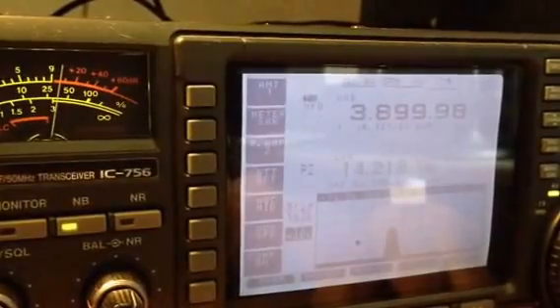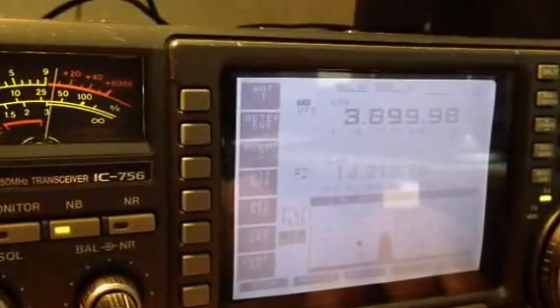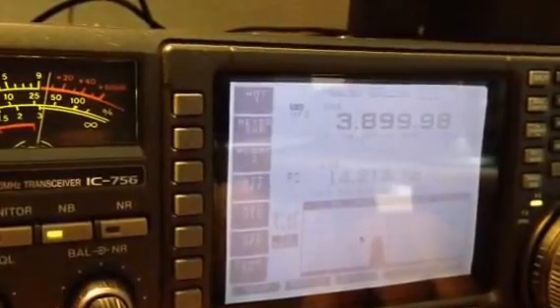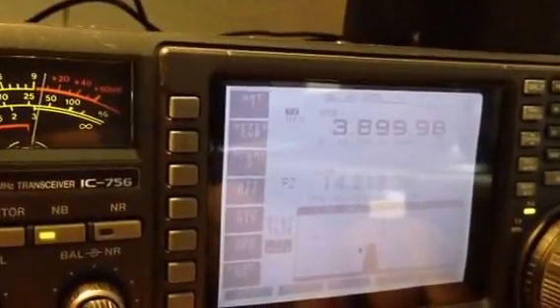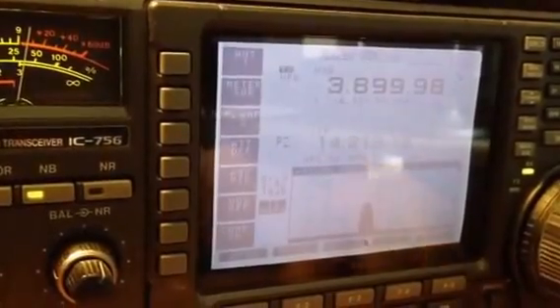So now let's take a look at a vacuum tube, an older rig. We're looking at a different type of sideband suppression system using switched capacitors and shifting the IF — the lower IF frequency — slightly, and see what kind of performance we get.